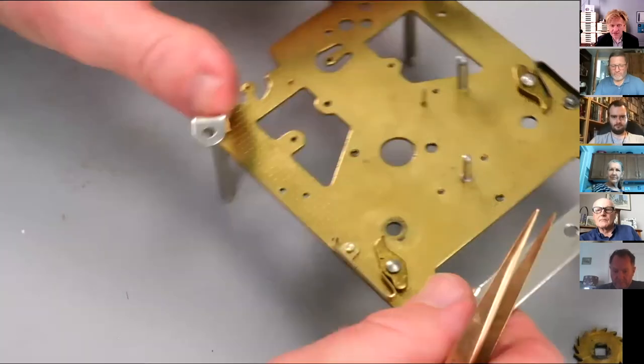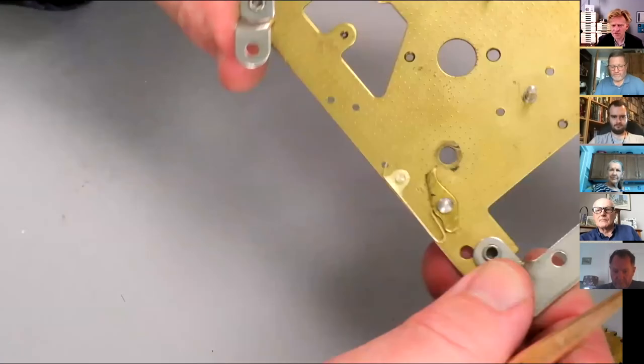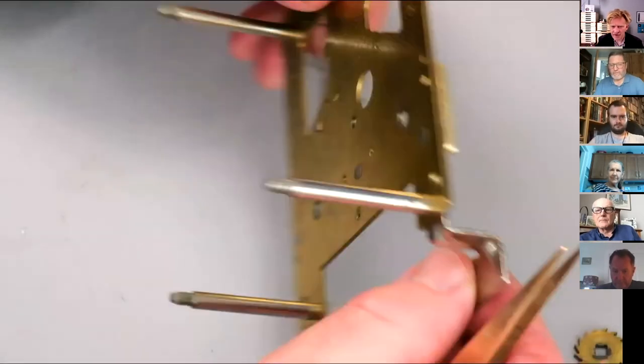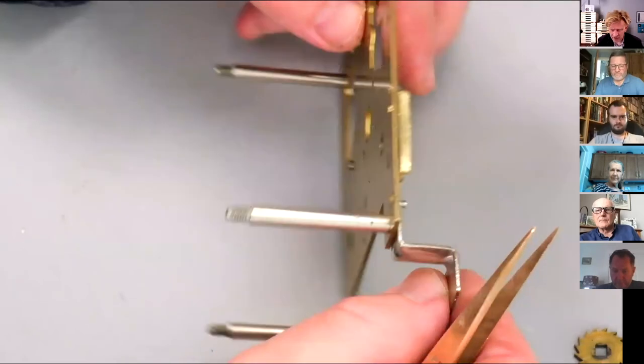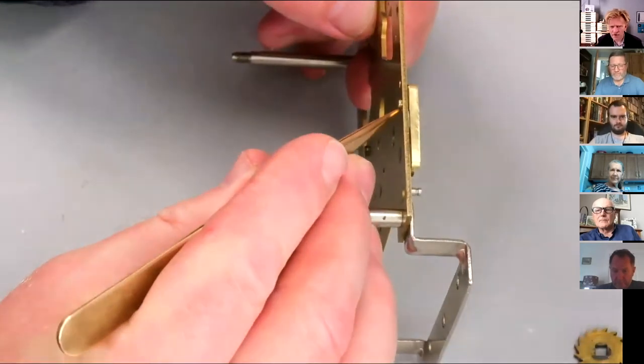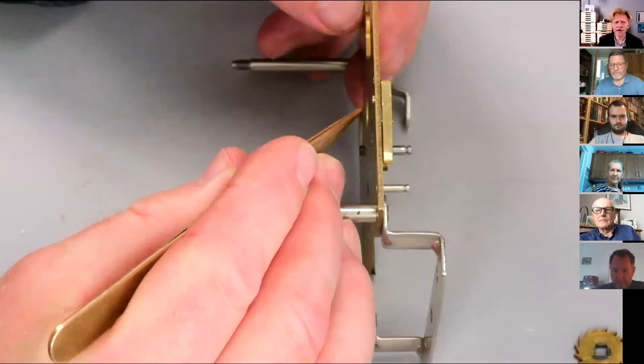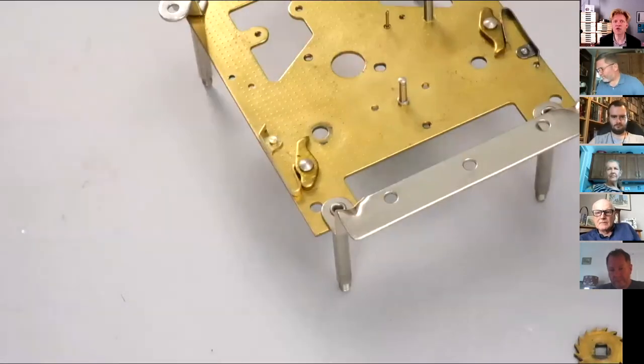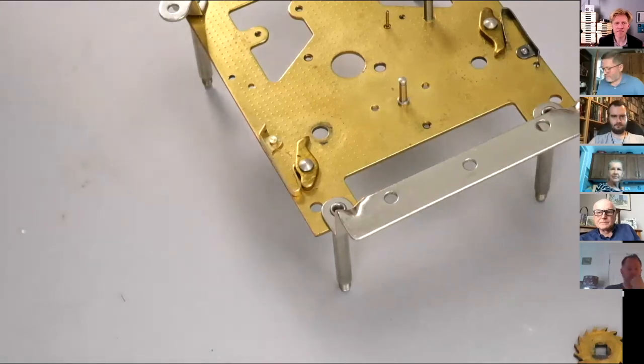Right, so that's ultimately what we want. Okay, I've left it a bit high, but anyway, and I've left on the inside, if you can see there, about half a millimeter, something like that, to rivet over. Now, again, for beginners, when you first start doing this and you think half a millimeter, that sounds like I need some specialist measuring equipment to do that. You don't. It's amazing how quickly you get used to the scale of things.